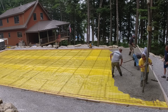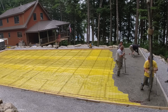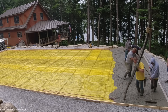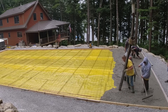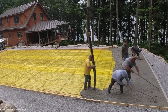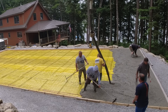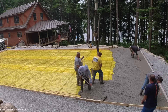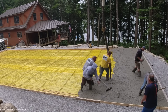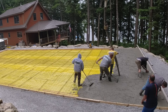We'll get the slab put in today. I line up the concrete and the pump guy, and here we are. We got four trucks coming — about 36 yards. We figured it's a little bit thicker in the middle. The slab crowns an inch and a half in the middle because the homeowner wanted it to crown a little bit so when it rains he doesn't have any puddles sitting on it — it'll just run off and the slab stays fairly dry.